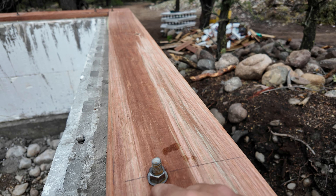We got our sill plates down — these pressure treated boards. These are two-by-eights, bolted down at 72 inches on center, and at all the joints we have bolts every 6 inches. Getting these boards lined up is a pretty simple process: line the board up in front of the bolts, mark it with the square to show where the bolt goes, then come to the outside and carefully measure from the outside of the ICF wall back to the bolt, then transfer that measurement to the wood — about 5 inches or so. Drill a hole, do that 40 times, and bolt everything down.